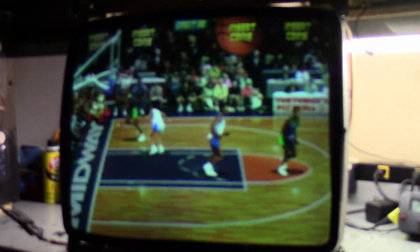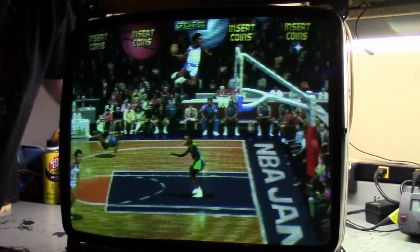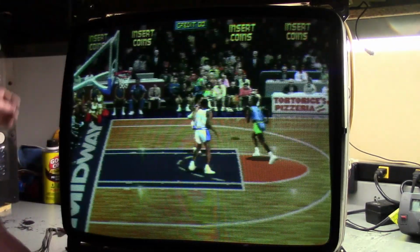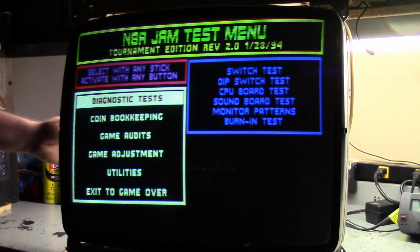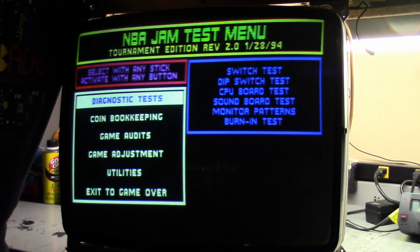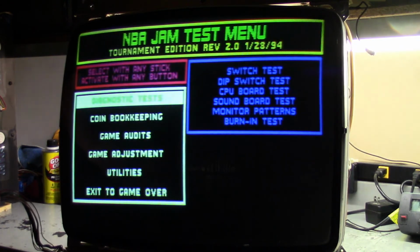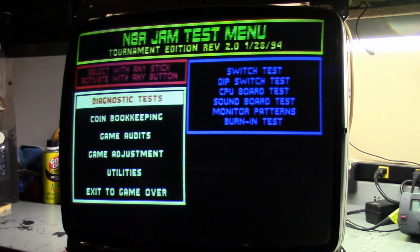Contrast and brightness down. Screen up until you get raster, back off until they go away. Contrast, brightness. We are way out of focus. That's good there. Not quite. That's not quite good. Let's just go into the menu here. And we'll leave it here. There we go. Let's turn our contrast back down. Well, right about there is as good as I can get it for now.